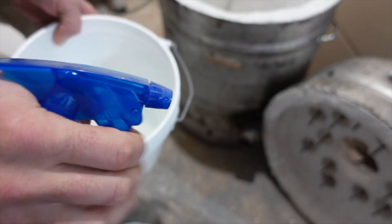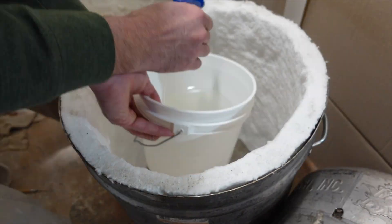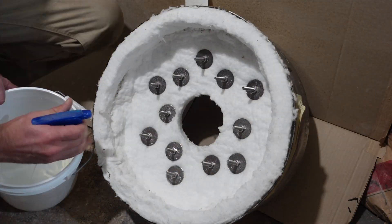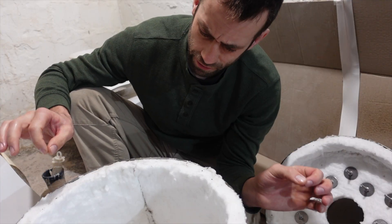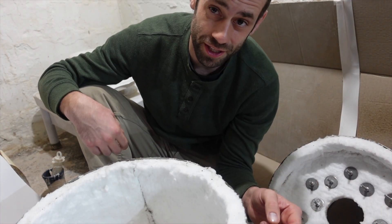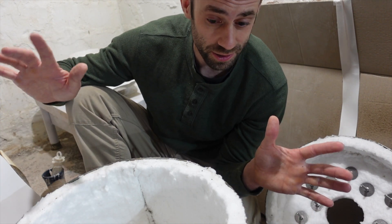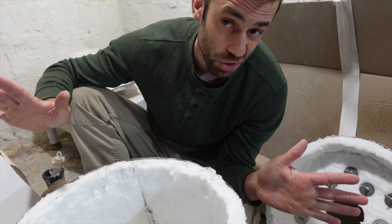This is the first time I've used this product — it's known as a rigidizer. Once it dries and goes through a heat, all the dust particles should be trapped and locked away. I'll let that dry and give it a few more coats. It'll be interesting to see how many people skip this part and then comment 'you need to seal your ceramic wool' — it doesn't look sealed, but that's what the product is made for.